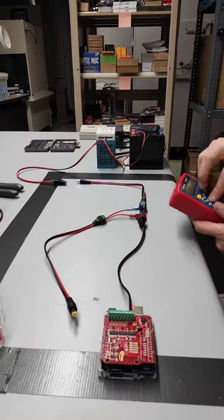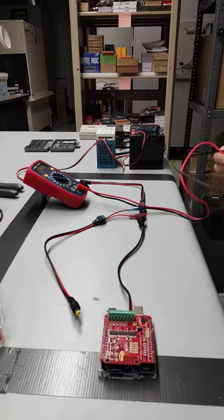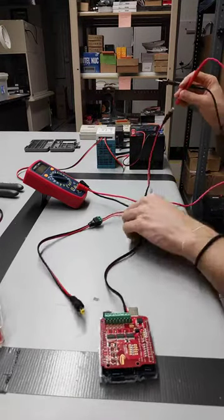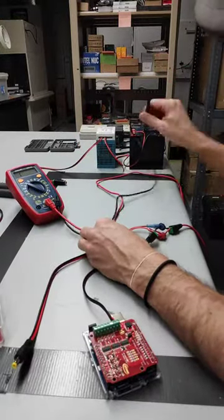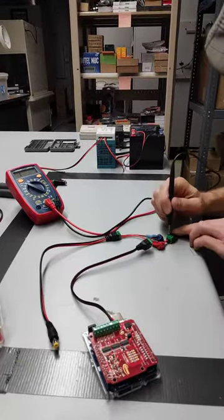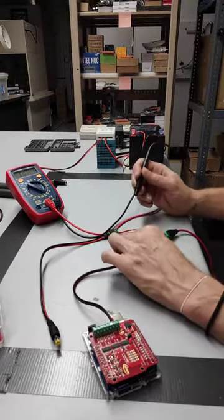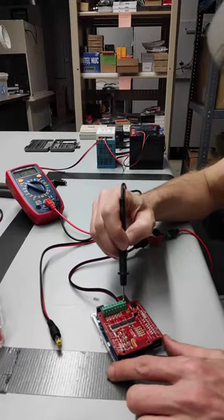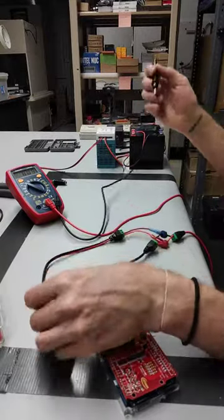Infineon board. Now we want to do some basic continuity testing here to see that our power is getting through. You can actually stick that through for positive into the center there. See if we get positive. Well, see where we get positive. So we have positive there. Positive after the split, positive after this split, and positive coming in there, and that should have positive all the way there.